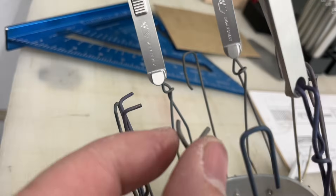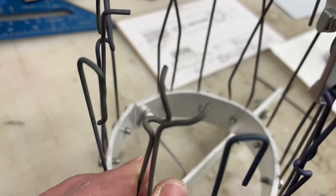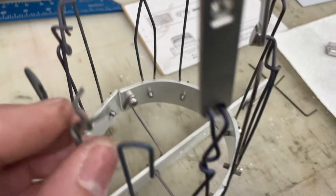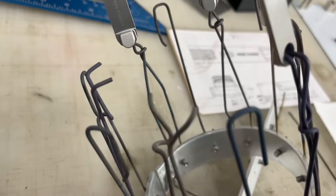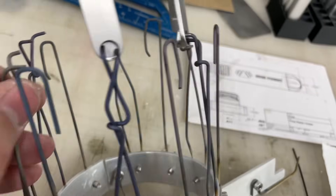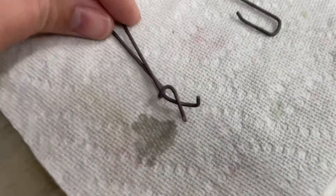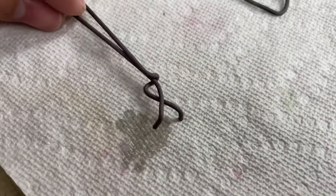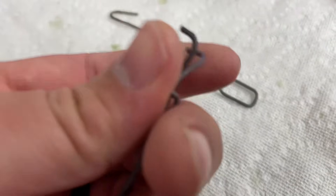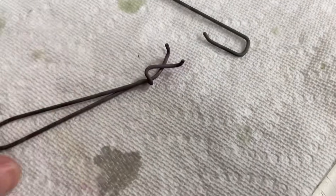Here is my racking. I rack from the top, which works for my parts because I'm moving them a lot. Racking is really, really important — if you have a bad connection, some parts will get more amperage than others and it'll mess up basically all of them, and your colors won't be consistent. I use welding wire to make my racking and rack vertically. You need a lot of spring tension to get good contact, and I found that if you put a fulcrum in the middle you can get a lot more force.